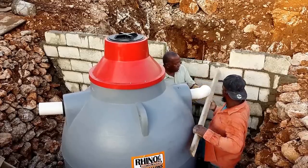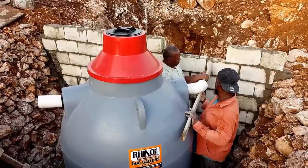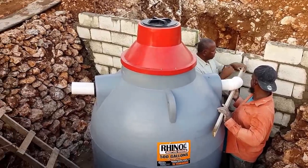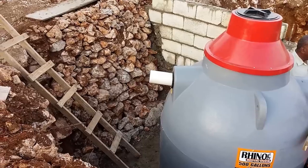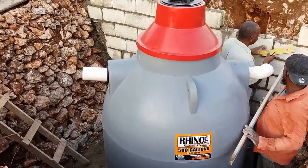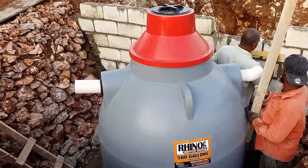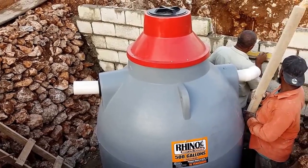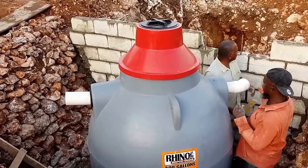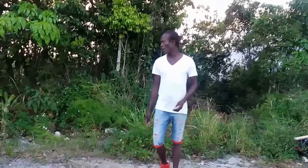They're trying to find the correct level where the outlet will go into the septic. On the left is the inlet, which will go straight over to the manhole. He's going to chip out right where the block is so that the pipe can go over into the septic. We're finished for the evening.